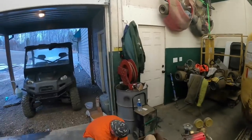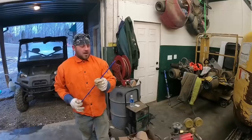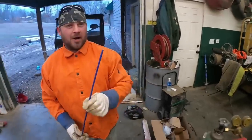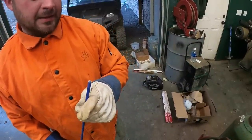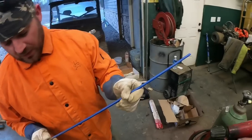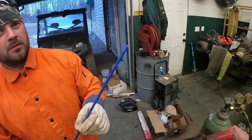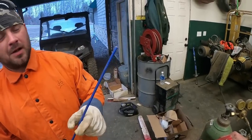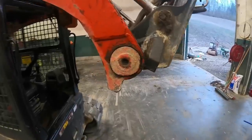But the way we do it, I hope we got a big enough rod. Oh, you got a Smurf rod. Yes, pretty little Smurf rod. So what's that rod made out of? A little bit of magnesium, carbide. So basically we're going to light that thing up like a sparkler, right? Yes, we are. And then we're going to shove oxygen to it. Yep, a lot of oxygen. And then you're going to take it and shove it straight through that hole.